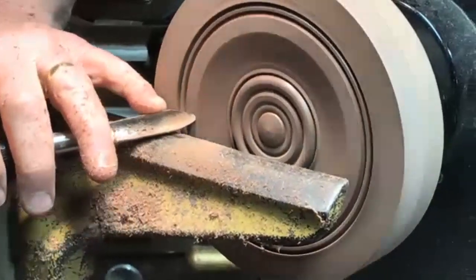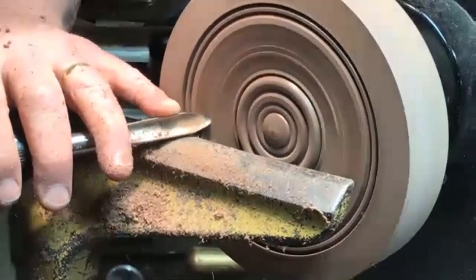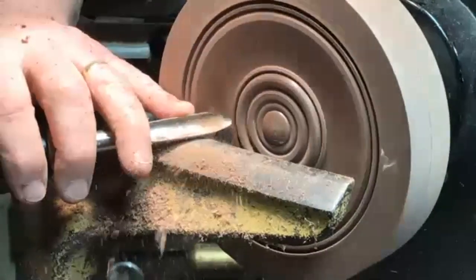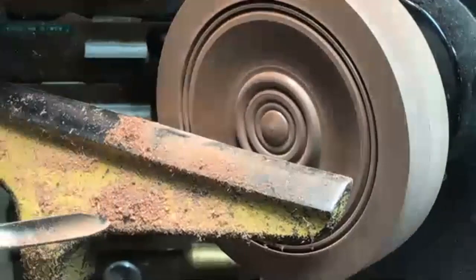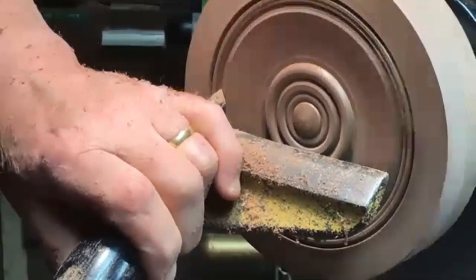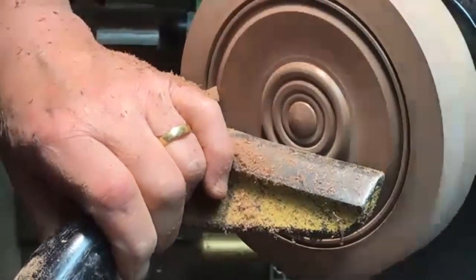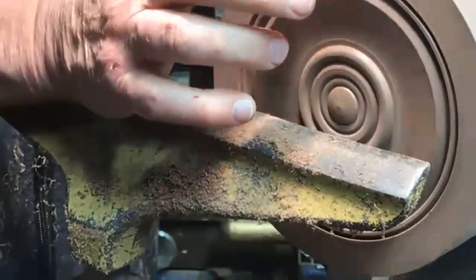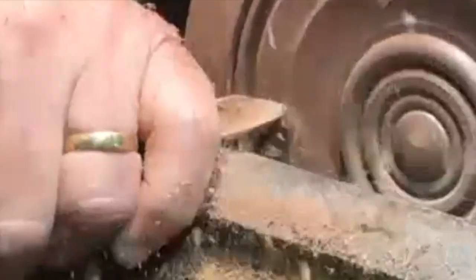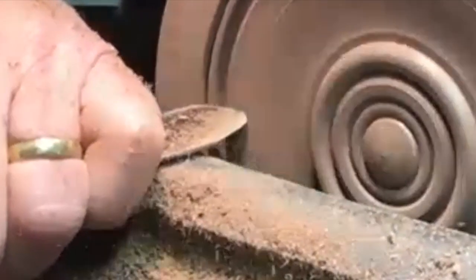It's just a push cut - get your flute at about 2 to 3 o'clock. Let's come back on that, just peel cut that off. Then I'm going to put another half bead right in here. I don't want to end up with three-quarters of an inch out here on the edge - I'd rather have that tapered down, so I'm going to cut this down a little bit too.